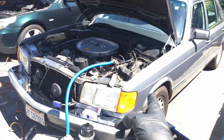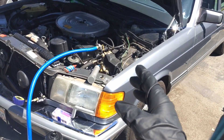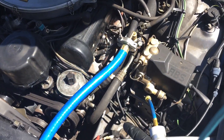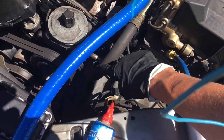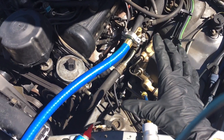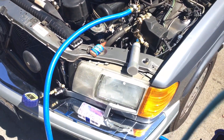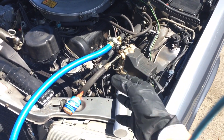I've done this vehicle in the past, several years ago. All the refrigerant is out of it. I did condemn hoses on this, and on these hoses where I picked up the leaks before, the refrigerant is literally coming right through the rubber on the hoses, but it leaves no oil trace. It's a substantial leak. I think it was about three years ago I did this, and it's down to zero.